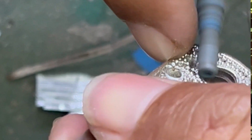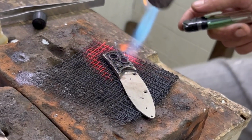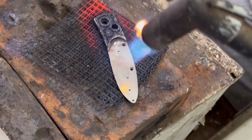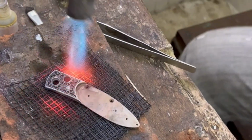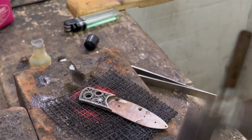Once they're all sort of held and the pattern is visible, then you use heat, and you heat that whole assembly up to the exact moment where all of the metal begins to liquefy. And as soon as it begins to liquefy, it bonds. And all of those separate, in some cases, hundreds and hundreds of different balls and pieces of wire become one piece of metal with that substrate, with that William Henry frame.